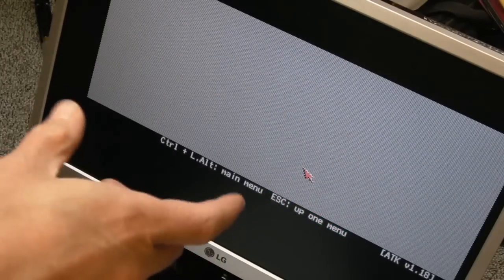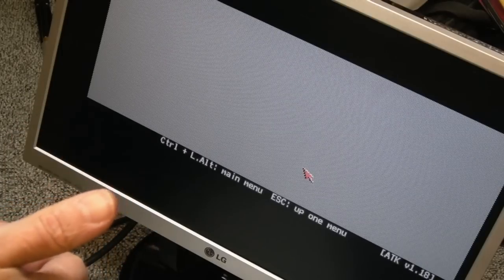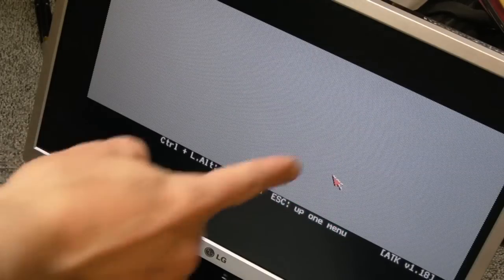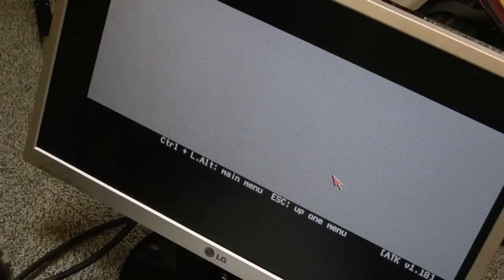Anyway, the problem here, I had two missing connections on the 04, the HC04 that the scan doubler uses. The last one was on pin 5, which goes to the little variable adjustment on the back. It's a little variable resistor, I think. But you can see now, it's crystal clear, that is solid. This is what this should look like.